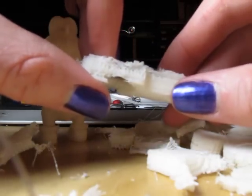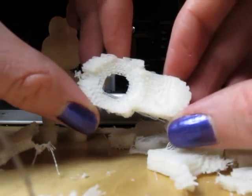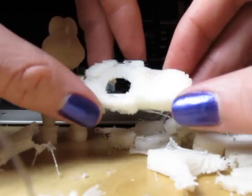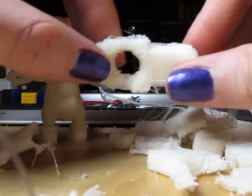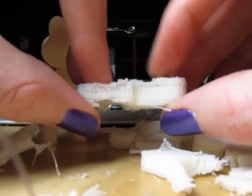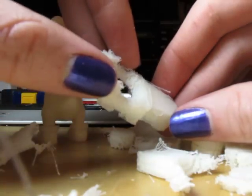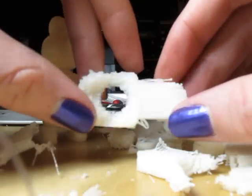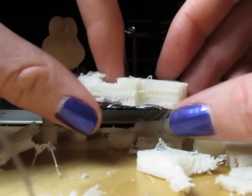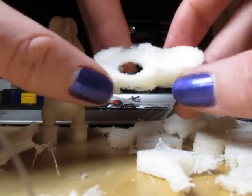This is the support material that Skeinforge is generating, printed with my MakerGear Stepper Extruder. You can see it's actually pretty solid under compression, and it does a really good job holding up the model. It's actually made up of a lattice of very thin threads, and I printed these using a flow rate that's about 75% of what I usually use, so the plastic threads are thin and not very strongly stuck together.